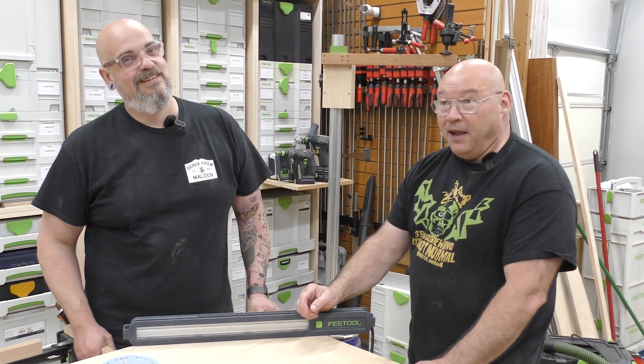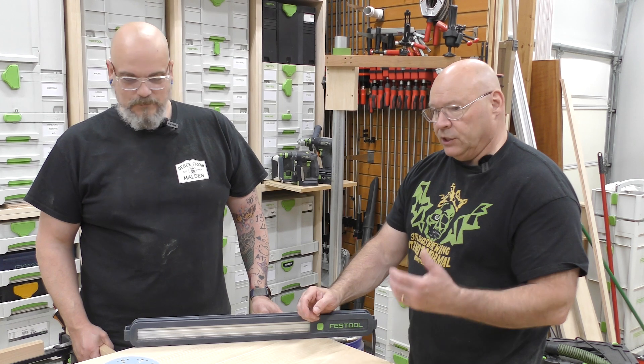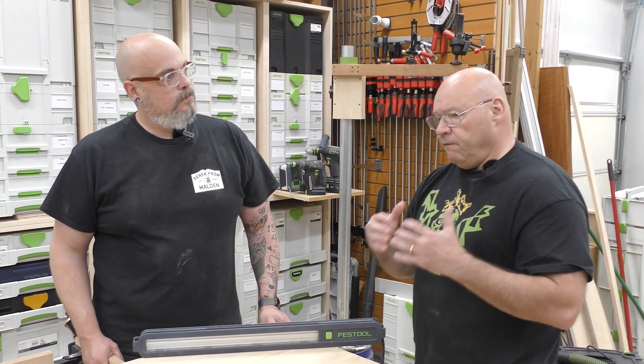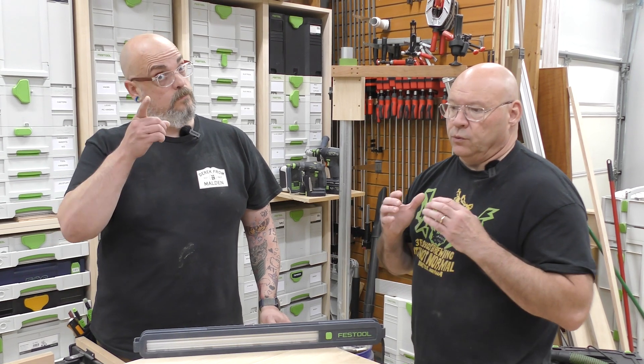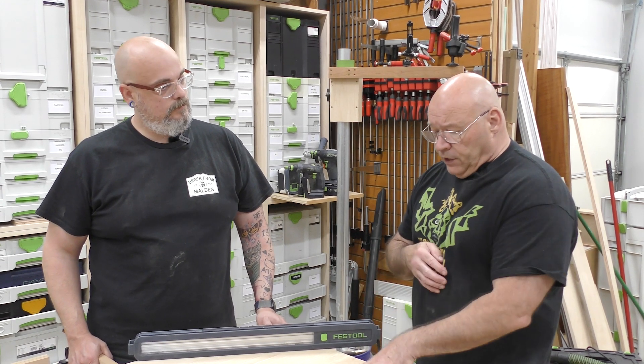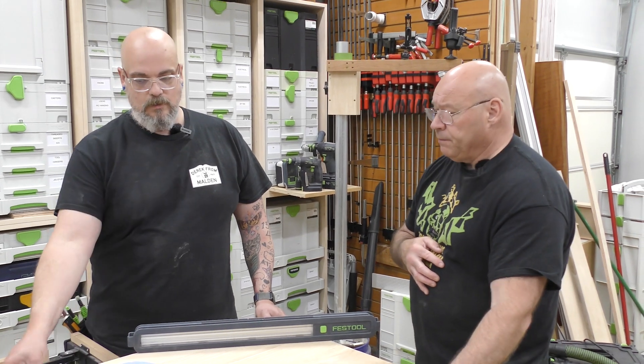It's time for sanding — my favorite thing. I don't know too many people who like sanding, Big D, but it's just that natural progression we have to go through because we want our finish — which is going to be Rubio Monocoat — to work perfectly. I don't want to be sitting at this desk seeing swirl marks. We finished the top, bottom, and natural edge with 40 grit.